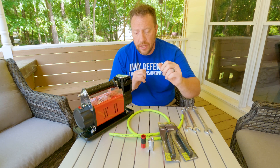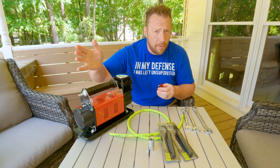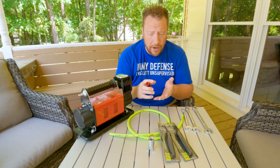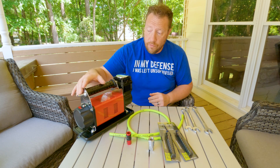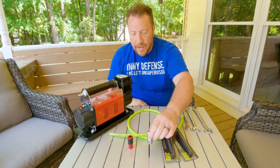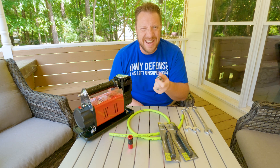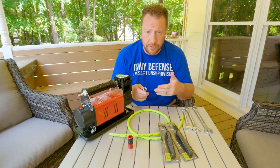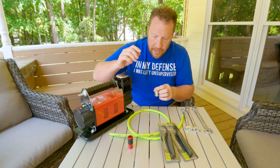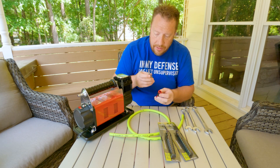The problem with these is, if you have any type of air inflation system or air tools or air-up hoses that use a standard — I think they call these the AM or IM fittings — just a standard American style air hose fitting, those fittings don't fit onto these compressors. All of these compressors use a Japanese style air hose fitting, which from the best of my research is referred to as a Nitto style fitting. I don't know if that's Nitto the same as the tire company or if Nitto is just a common name in Japan, but these fittings have a slightly larger diameter inside and they don't fit.